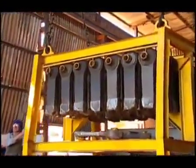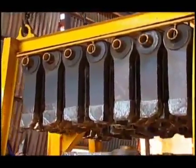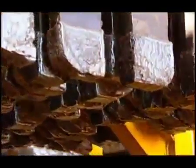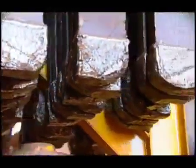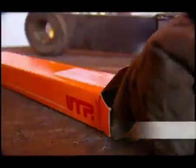Other areas that need our attention are the shredder hammers and chopping knives that are responsible for the preparation of the sugarcane fibers by opening them before they're crushed. These parts undergo extreme wear and tear because of abrasion. With new parts in these areas, we provide extremities protection with a chromium carbide alloy like the UTP-7100 or complex carbides such as the UTP-713.